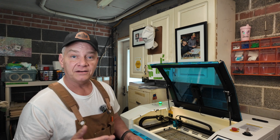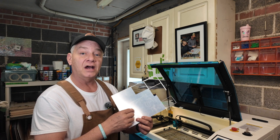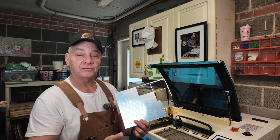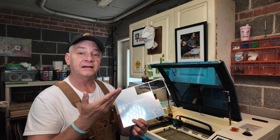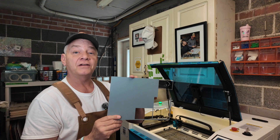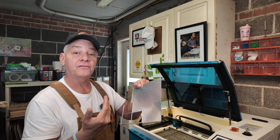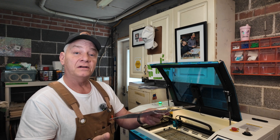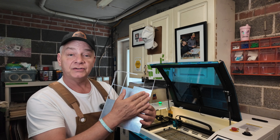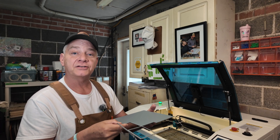I'm fairly new to lasers like many of you are. All I know is I've been told and seen many videos that you should not be engraving on the reflective side — it has something to do with the fact that it refracts or reflects the laser back at itself. We're going to be engraving on the back so we can see it through the mirror. I put it mirror down and leave my plastic on; if you pull the plastic off, you can put mask on there to stop it from getting scratched on your honeycomb.